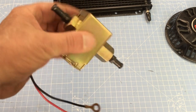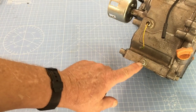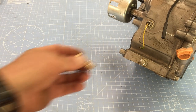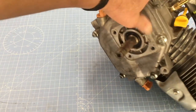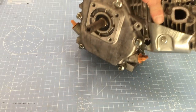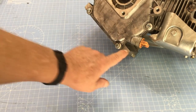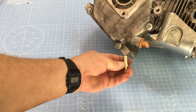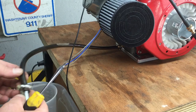I don't hear any complaints yet, so I'll keep going. Let's go ahead and pull the oil from one of the drain plugs, like this one. Now, to tap into the drain, you'll need an M10x1.25 nipple for the 212cc engine, and a 12x1.25 for the larger 420cc engine. And we can return the cooler oil through the other drain plug. Now this is a crazy plan, and I know it, but it's crazy enough it just might work. Let's do it!